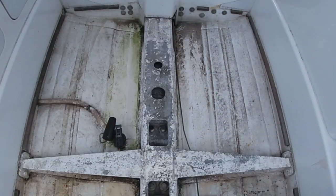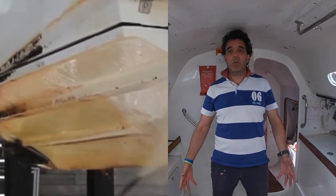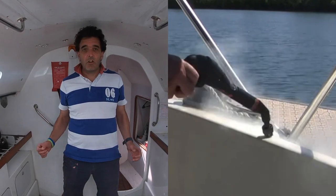G'day and welcome to today's Mum 36 rebuild episode where we take a look at the best ways to clean dirty fiberglass. There are three primary ways you can go about cleaning fiberglass: first, power washing, which doesn't work too well when you're in an enclosed space and don't have 240 volts of electricity; the second is steam cleaning, which can be difficult as not many people have steamers and it's not great for an indoor environment. So today we're going to take you through what I think is the most effective way for all types of fiberglass cleaning, and that is with oxalic acid.